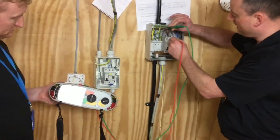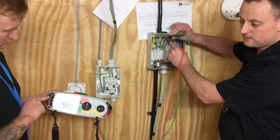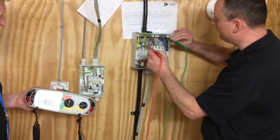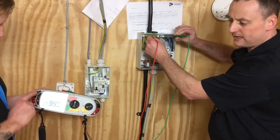I'm going to go into the ring final circuit — press again. And then finally between all the neutrals and all the earth conductors — in this case CPCs — going out to the circuits, we've all tested at the same time.